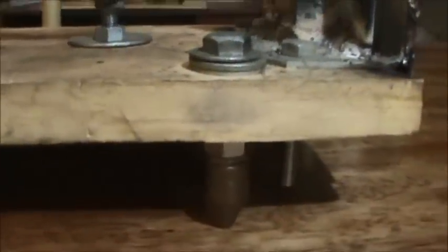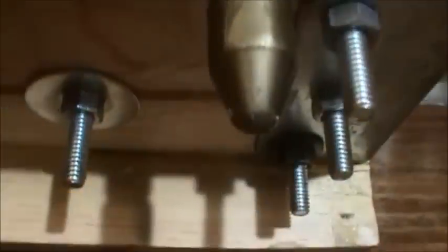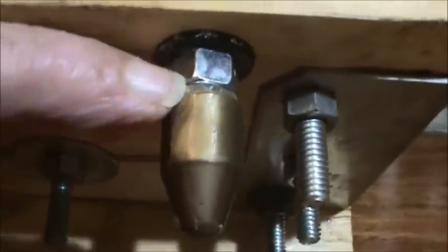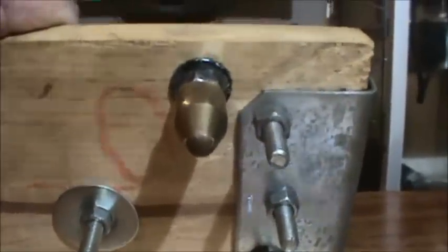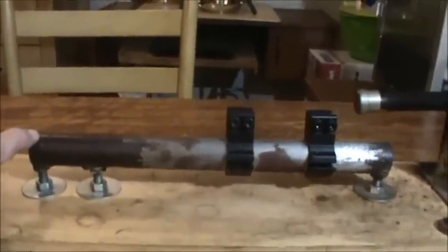Because of the metal plate across the back, I couldn't use a wood board there. Right here is the foot that it rests on — I used a 5/16 bolt, a few washers for shims to get the right height, a washer underneath, and a nut, then ran another nut up on top for this plastic protective foot to slide on. I didn't want a bare bolt scratching up whatever surface it sits on, so I've got that rubber foot on there.